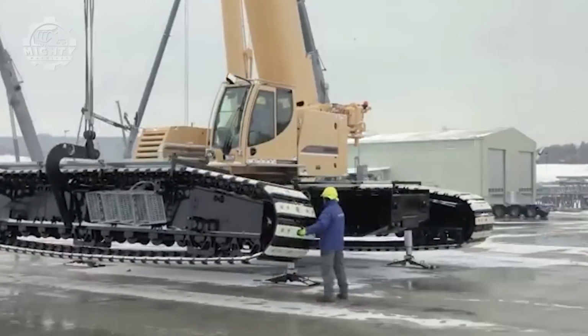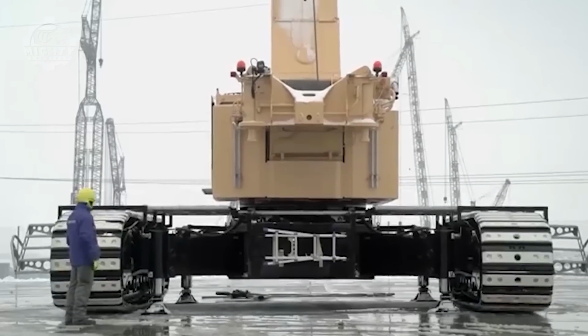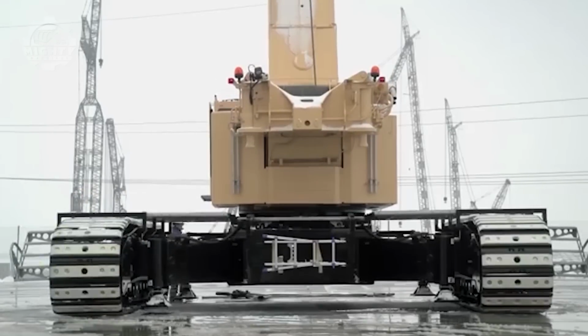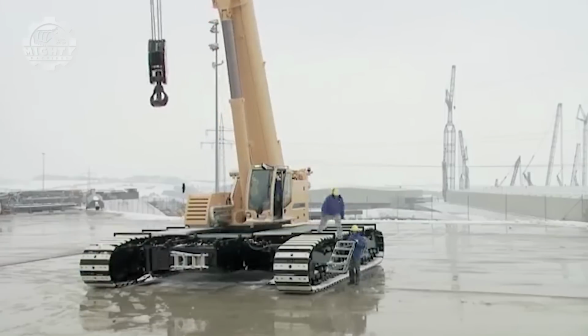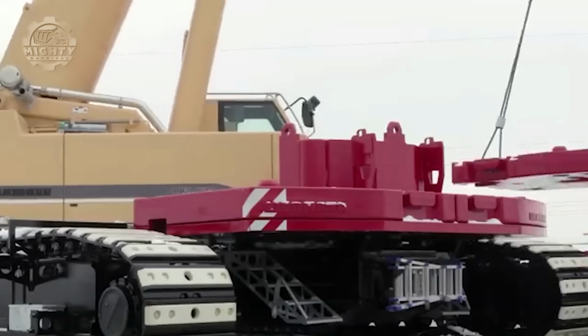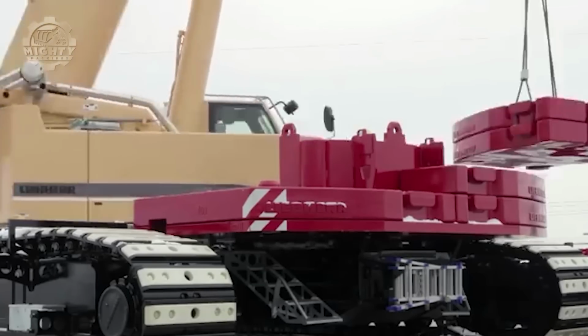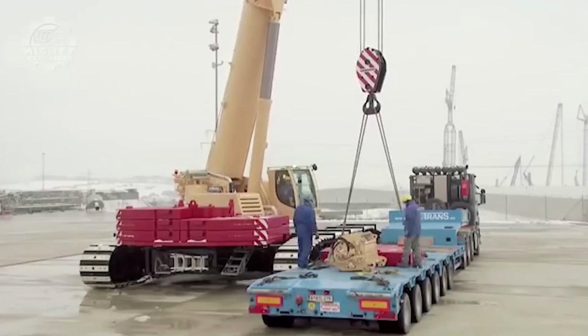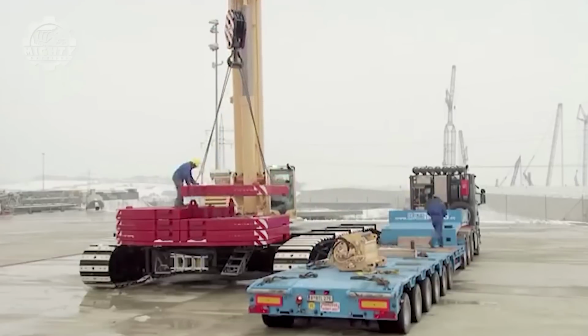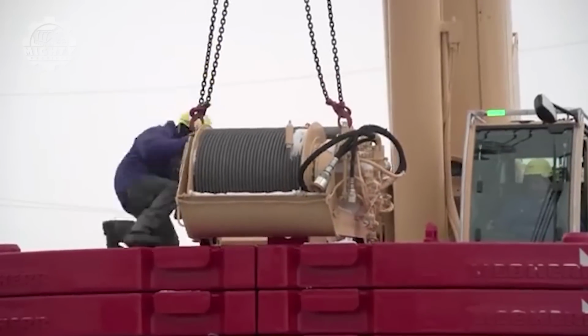Its crane can also be moved easily even with a full load on the hook through its pick and carry principle. Then, it can also carry out crane work at a lateral angle of up to 4 degrees even when the track width is reduced. Even when working with tasks concerning off-the-road handling, its performance and maneuverability are still superb thanks to its crawler travel gear. When things get narrow or the space gets very limited, the crawler carrier width can be hydraulically adjusted.